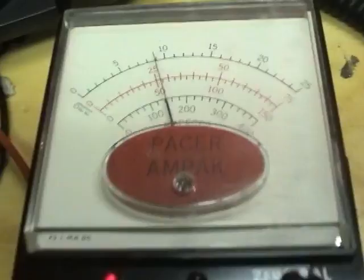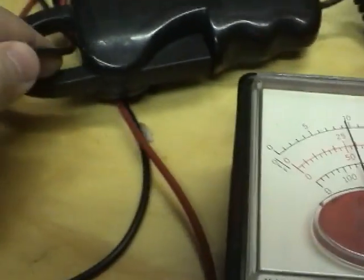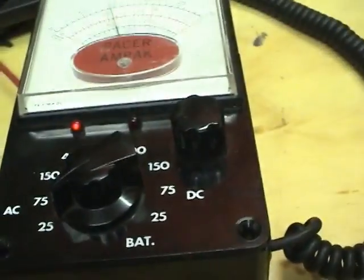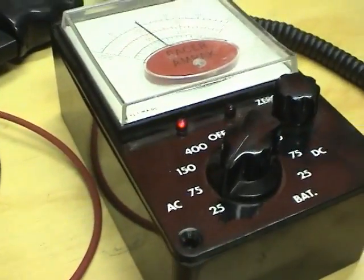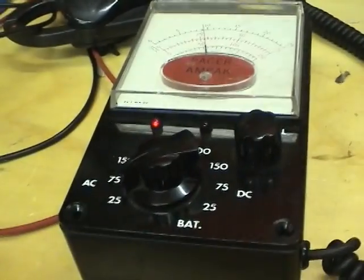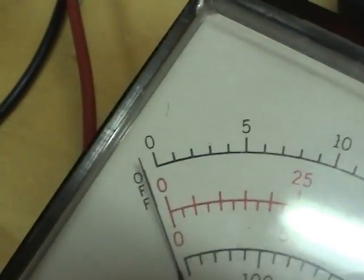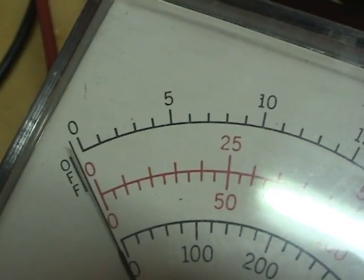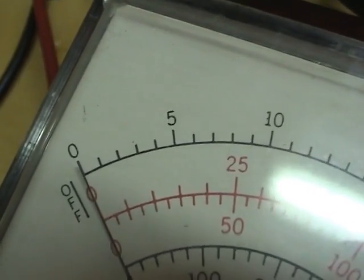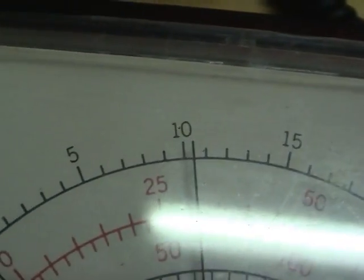Let's give this a tap — it changes a bit, it may need to be lubricated. Probably has to be calibrated, but it's not bad, seems to work decently. The front panel has been cracked. Actually it seems I was just using the meter wrong — I was zeroing it to the wrong position. It used to be zeroed to the off position, then you turn it on and use the electrical zero control to zero it fully. I have to tap it a bit to get it to stabilize properly. So now it's properly zeroed, and if we clamp it back on, we're at about 9.9 amps — tap it a bit — that's much closer. It goes at about 10.3 to 10.4 amps reading.